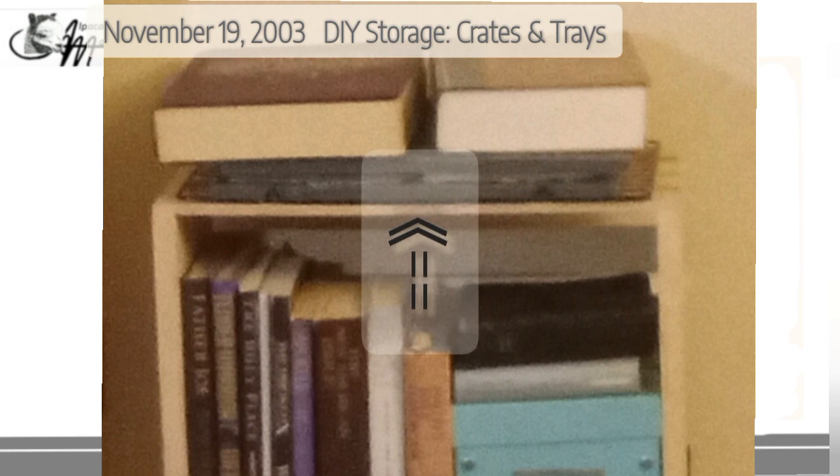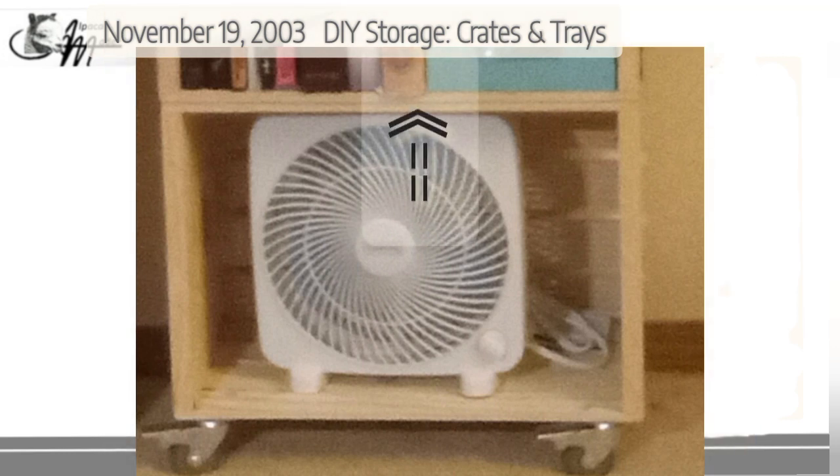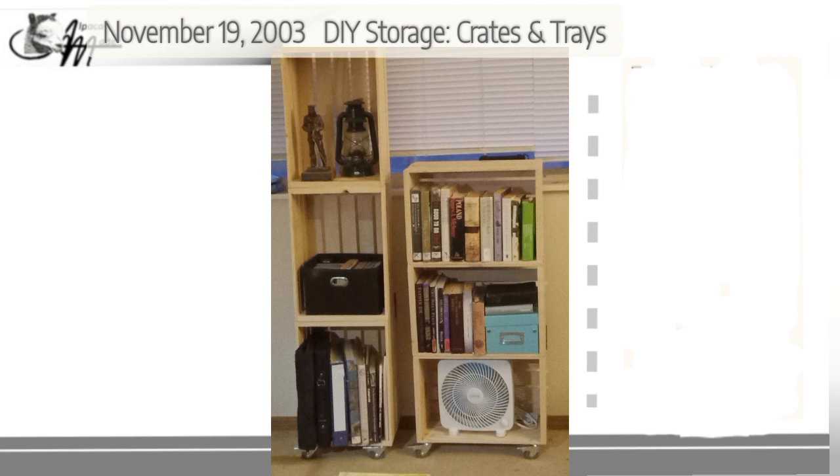That half inch to two-thirds of an inch is not going to support as much weight, because it's made out of slats, as that solid inch and a half will when you put the crates in a vertical stack. When you have the horizontal configuration, the easiest way to fix weight issues is to slip a board the same size as your long crate face in between the top and bottom — that will strengthen it. For the top of your horizontal stacks, I would suggest putting an extra board on top and finishing it like a tabletop to evenly distribute the weight.